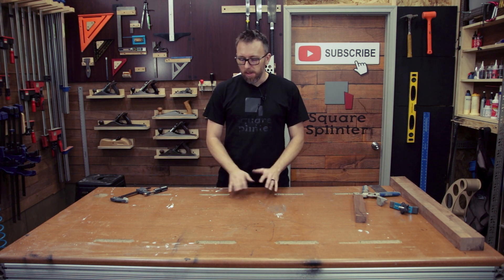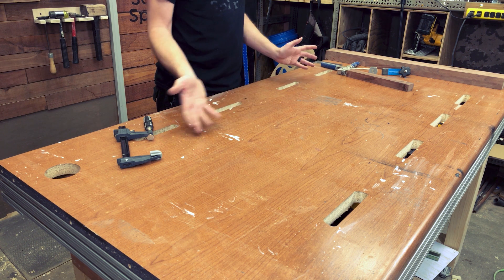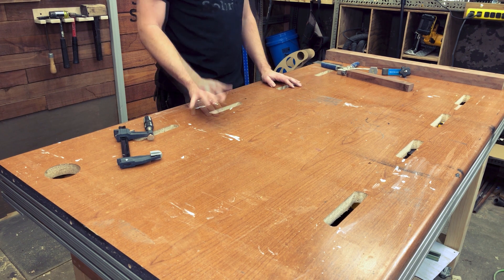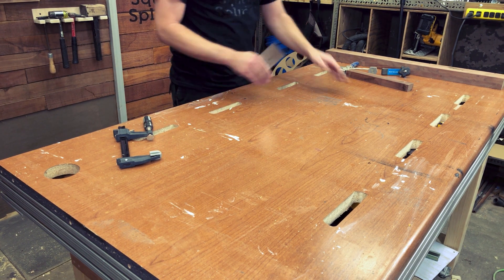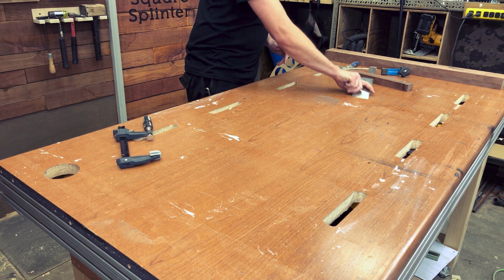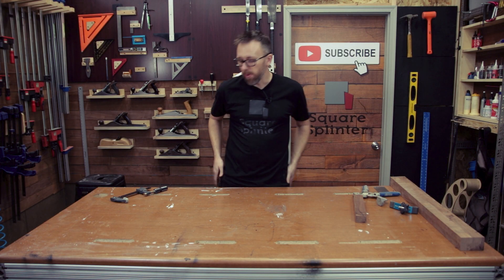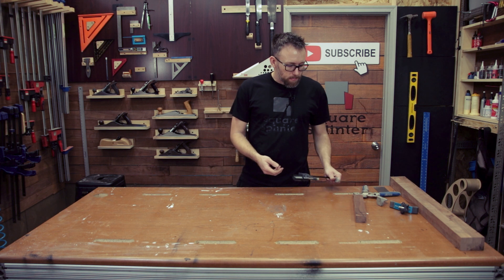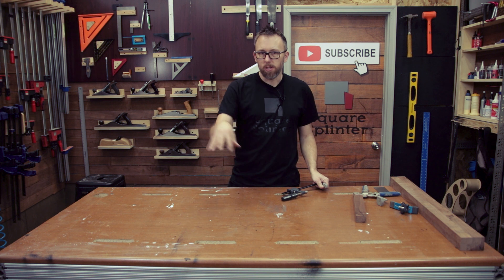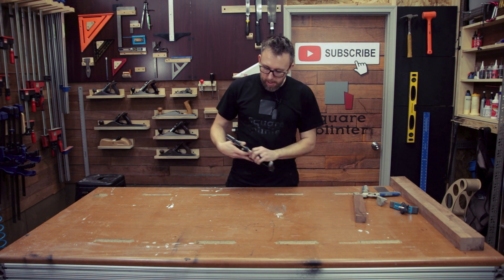First the positives — this whole desktop is perfectly flat. It's decent grade particle board, so there's no reason why it shouldn't stay flat. It's well supported. The frame is square and flat. That's been great. It's also great that if there's glue stuck on here, you can simply pop those off really easily, so it cleans off really well. There's some paint on here, but I don't really care about that. Another good thing is I did route some slots in here. I didn't really want to put a bunch of dog holes in here because I'm afraid it'll weaken it too much, and this probably weakens it a little bit, but it's been great.